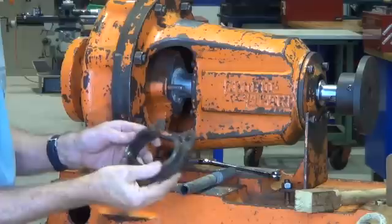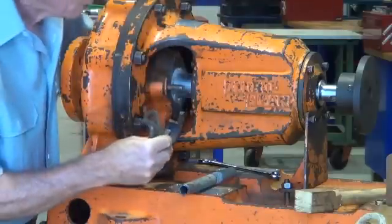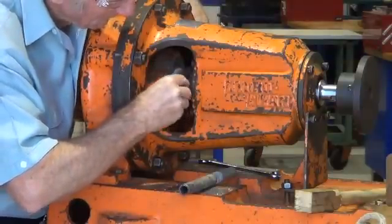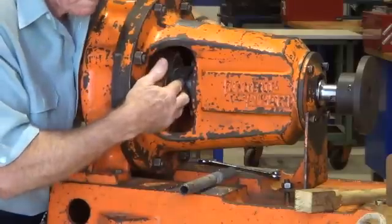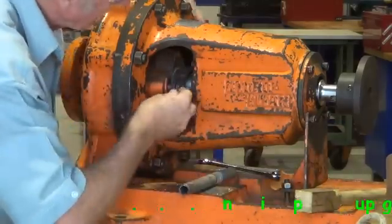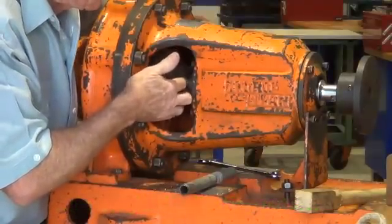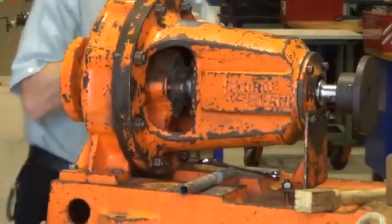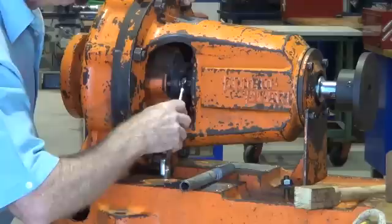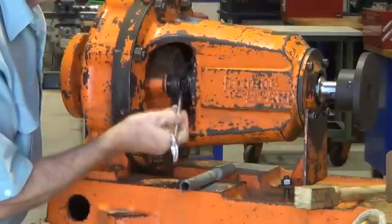You can see the packing is right out to the end there, and now we're going to put the gland over the shaft — wrap it around the shaft and put it into position over the gland adjusting bolts. Just fitting the nuts on and then we'll adjust them up a little bit. It's important that we've got plenty of adjustment left on those two bolts so that as the weeks and months go past we can periodically just nip up the nuts and that will stop any leakage which might be occurring.